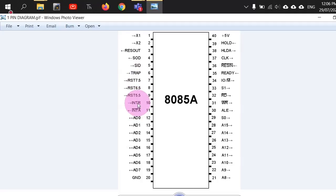The external memory interfaced to the microprocessor receives data through the address and data buses. The data bus of one byte can copy one byte at once to external memory — that is parallel transfer. In some cases, you want serial transfer — bit by bit. For that, there are two pins: Serial Input Data (SID) and Serial Output Data (SOD). The microprocessor can accept or send one bit of data at a time through these serial pins.